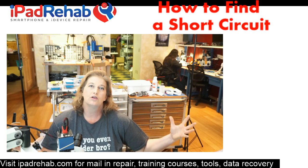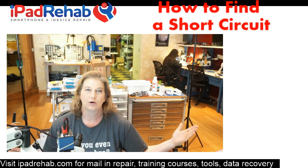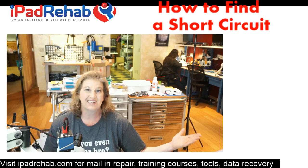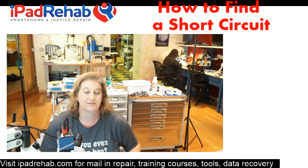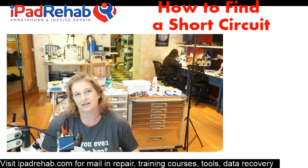So if you want to look at all possible candidates for who is causing the short to ground, you need to be aware of that. And if you work from the schematics, a lot of times it's a lot easier to see and understand your whole line and kind of form a hypothesis.